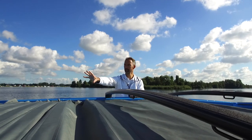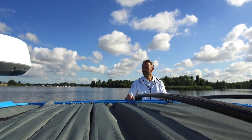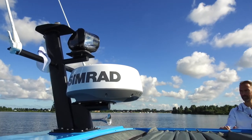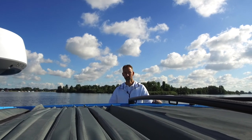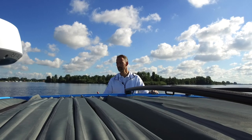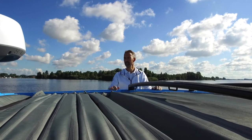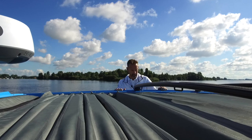The opening roof is standard on this boat. It's been fitted with a radar, searchlight, and VHF antennas as options. The mast can also be folded or removed. In Holland we sometimes advise people not to have the radar but instead install an AIS system — you send out a signal so all boats around you know who you are, your course, and speed. This is important for the Netherlands because you can then remove the mast more easily for bridges, of which there are many in Holland.